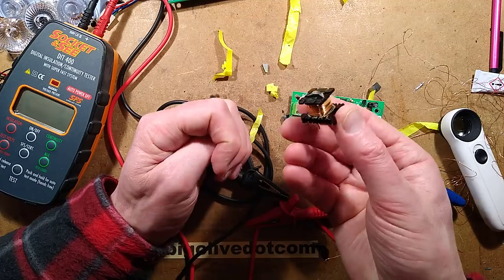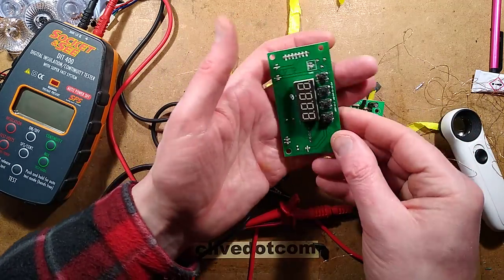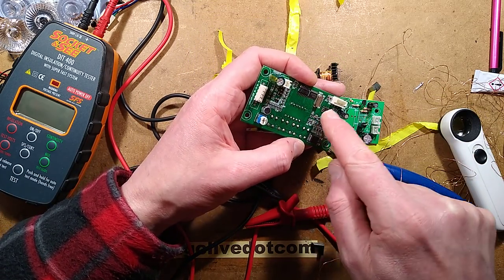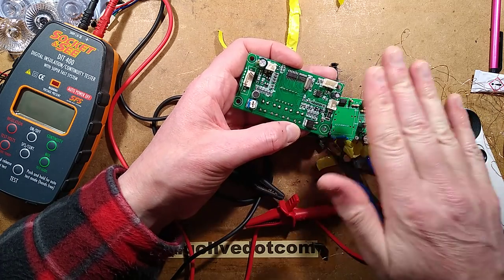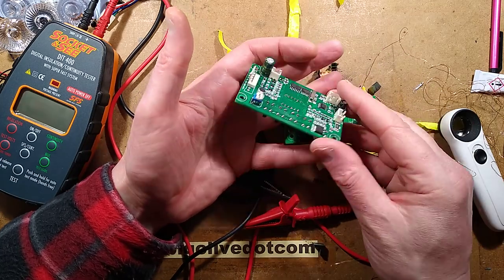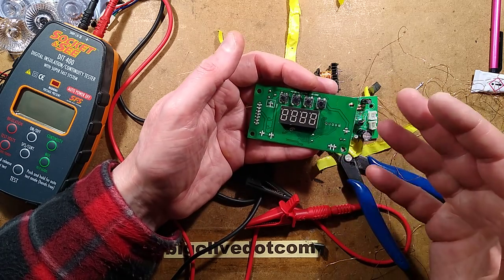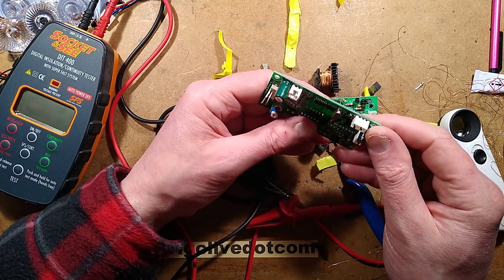In this case, it's just not got that, and that's why I'm always wary about these disco lights, that, you know, the mains side coupling across the low voltage side comes onto the circuit board and goes through this little driver chip onto the network. And that could literally just destroy lots of lights on your network. It could cause a lot of damage. If you're using a cheap light like this, a 10 or 20 quid LED light, and you've got a lighting rig that's covered in hired in lights, you could actually end up with quite a huge bill.